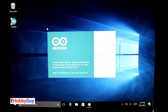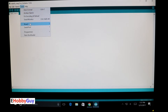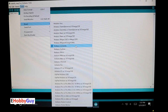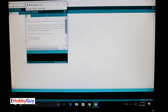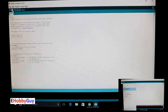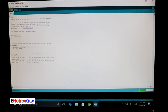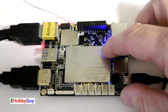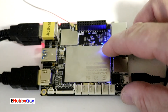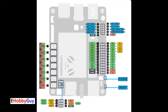Opening the Arduino IDE, the first thing I always do with a new Arduino is open the Blink sketch. I confirmed the Arduino Leonardo is selected as the board. When I tried to upload the Blink sketch it initially failed, so I checked the COM ports — there was a choice of COM1 and COM3. Switching to COM3 allowed a successful upload. The onboard LED tied to pin 13 is that blue LED we saw earlier, which is the Arduino's onboard LED.